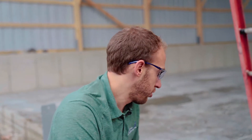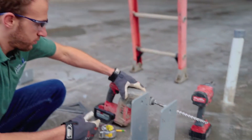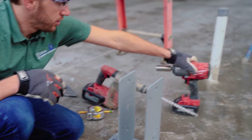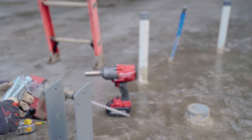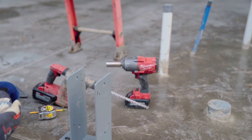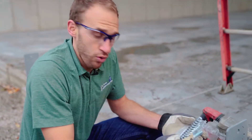Please refer to the design manual for additional concrete anchors approved by the Permacolumn manufacturer. I've got a concrete hammer drill with a 5/8-inch concrete bit, as well as an impact gun. The concrete anchor that comes with the Sturdy Wall 63 is a 5/8-inch by 6-inch concrete anchor, which requires a 5/8-inch concrete drill bit to pre-drill the hole.